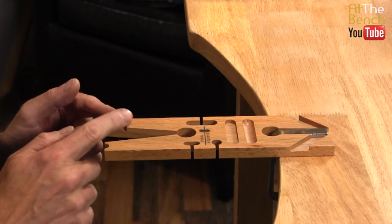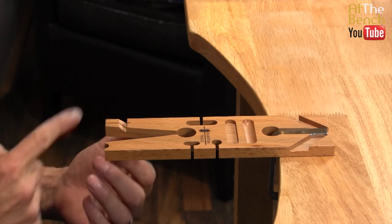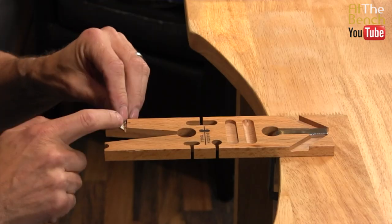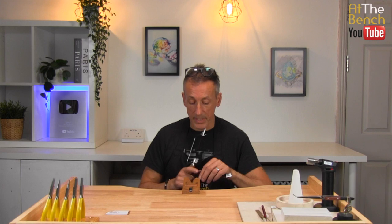It's also got this area on the end here, which is ideal for when we are cutting rings. The ring can be placed over the end, and it has a slot right down the centre at 90 degrees to the edge and also completely vertical. This will help us cut a nice 90-degree cut right across the ring. Or if we had a small piece of metal, we could place that within the groove, knowing this line is at 90 degrees — a good guide for our saw blade to keep it vertical and at 90 degrees to the edge.